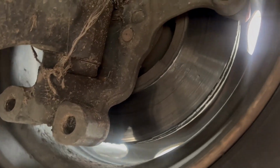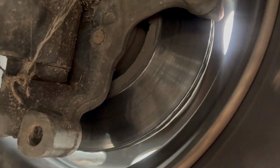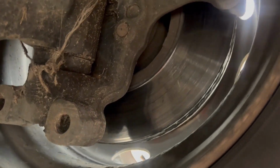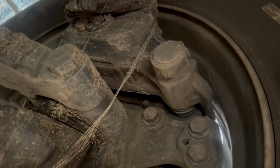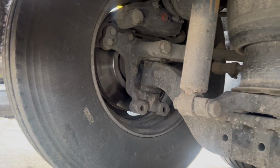Yeah, so I was saying it's jacked up there, just so I rotated it. Let's check the disc. Rotating it again now, check the disc on the inside, which all looks to be good. You can see it's spinning nice and freely itself. I'm not actually turning it now. But then if you get hold of the caliper, you probably can't see on the camera, but I can see it there, you can just slightly move it, which means it's just moving up sliders. So that one's not seized up. So what we'll do, we'll get jack down, jack that side up, see what that looks like.